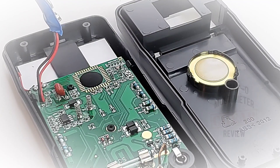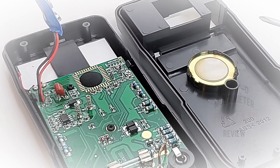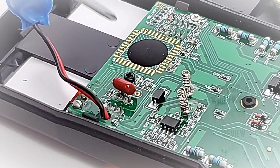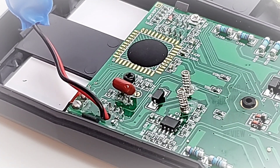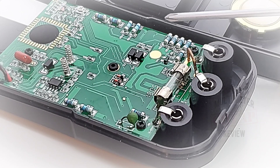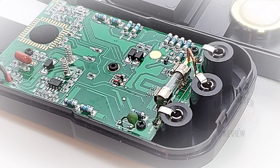Teardown time. On the reverse side you can see the piezo — not that small actually, pretty good size for a smaller meter, but no shielding. I've had many requests for a DIY on multimeter shielding — that video is coming up hopefully early next month, stay tuned. The main IC is cobbed, and we have a high-powered capacitor — not a lot of bells and whistles. No flashlight, no NCV — bare bones essential. The input jacks are of the split variety. It's a clean-looking PCB with no flux residue — really nice and clean.